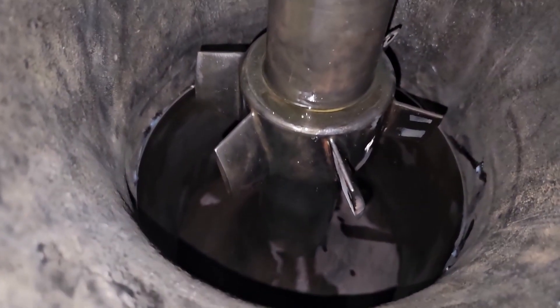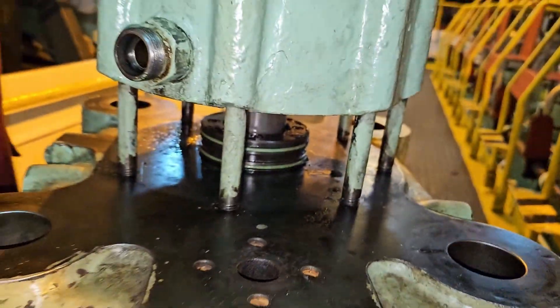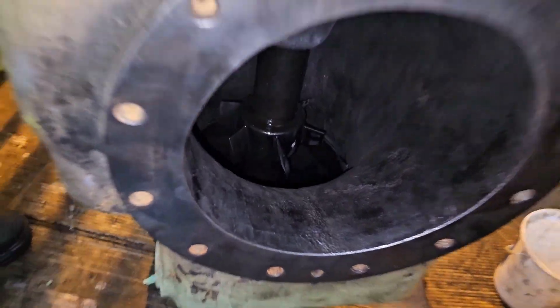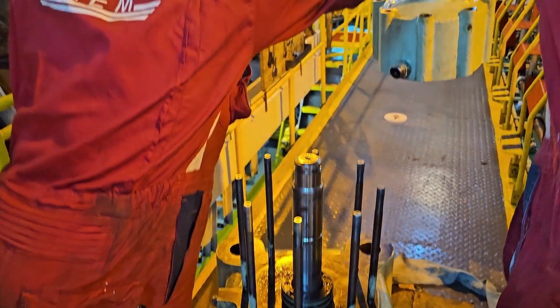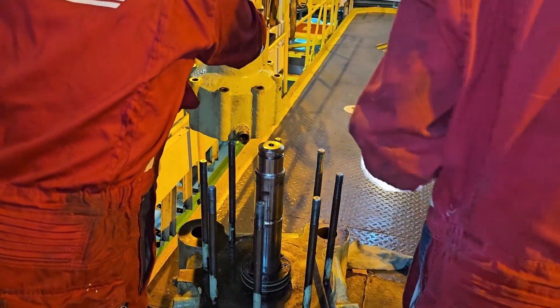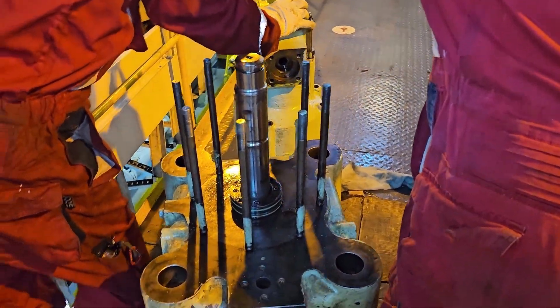After fixing it, you can see it is entirely in place. Now remove the oil cylinder. After removing the oil cylinder, fix the next part — the air cylinder. You can see the spindle vanes and exhaust valve cage are in clean condition. Lift the oil cylinder, keep it separate, and insert the air cylinder.